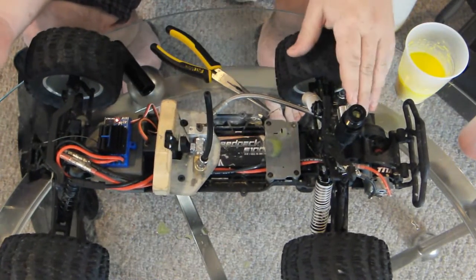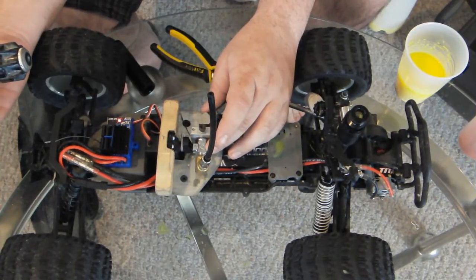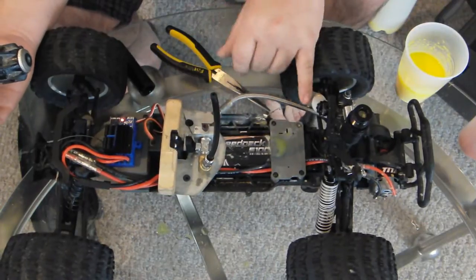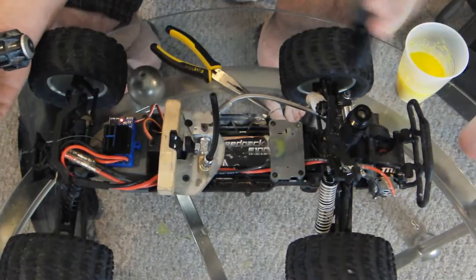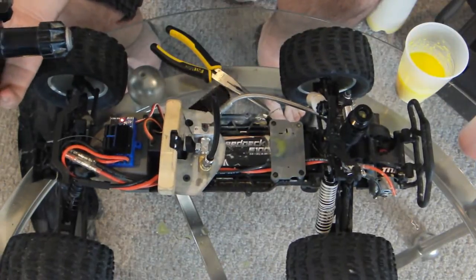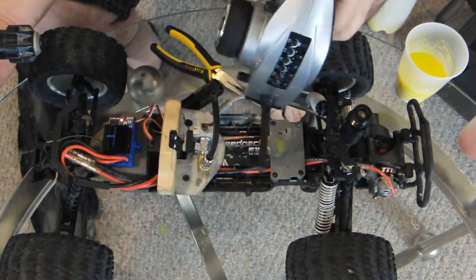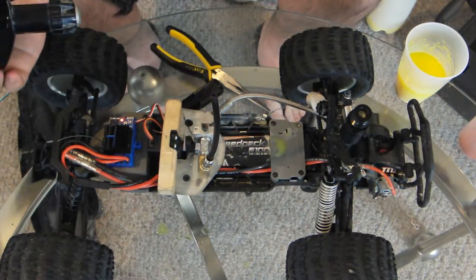In terms of the internals, you have an on-off ball valve, a 1/8 MPT fitting hooked to a servo, a piece of macro line, braided steel hose going to an ASA that's connected to a 12-gram quick charge adapter. So basically all it does to operate is I have a third channel on the transmitter that I can push back and forth to open and close the valve.